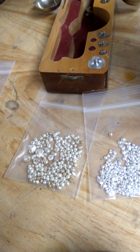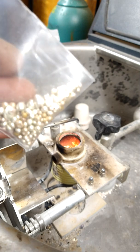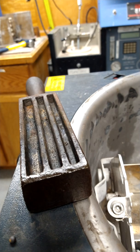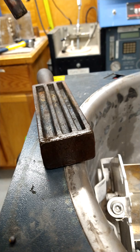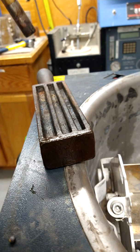First up, we're going to be making our sterling silver alloy and pouring into that ingot mold. I've already seasoned the mold — I treated it by heating it up. You always have to heat up your molds. When the metal hits it, it will be like cold water hitting a hot frying pan — it pops.